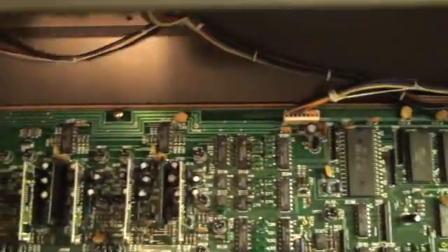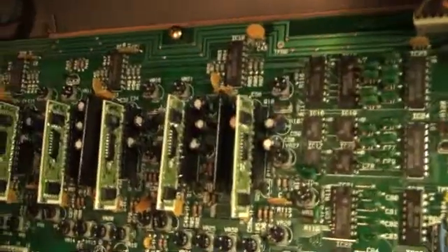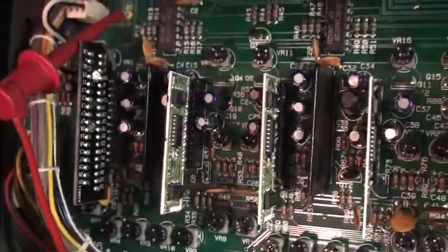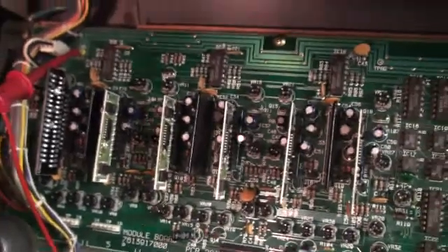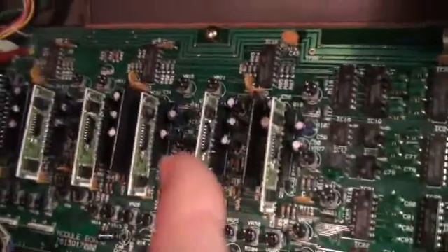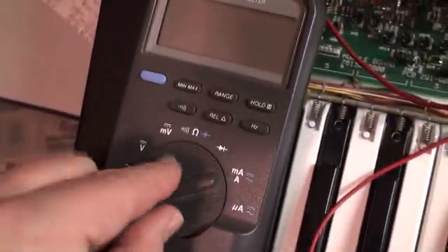So let's go over here and have a look. We've powered it up by holding down key transpose and turning on the unit. Let's put it into test mode and we're choosing poly1, which is the unison. Let's open up our hinged top and take a look inside. I am calibrating this unit with a full set of normal voices and then one analog renaissance. This is an example of how the analog renaissance can be calibrated perfectly to be indistinguishable from a stock voice, and at the same time it's a good calibration test. So I have the analog ground — see that AG test point there — connected to my common.